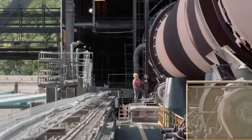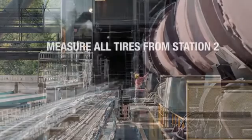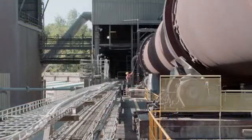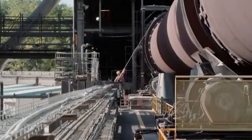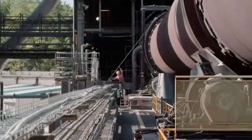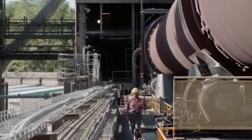The alignment check of the kiln axis is one of the most important measurements on rotary kilns or dryers with more than 2 piers. The straightness of the kiln axis needs to be within tight tolerances to minimize the stress in the shell and to distribute the support loads correctly among the different piers. Typical symptoms for misalignment are circumferential cracks in the shell near the middle tire.